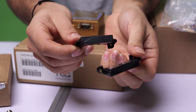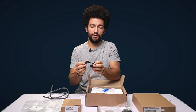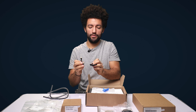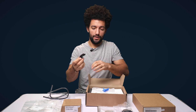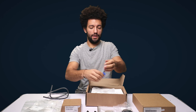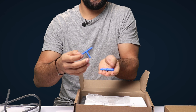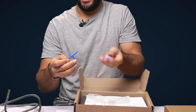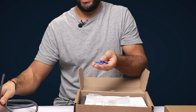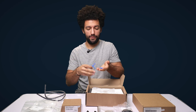These two adapters are to be used to allow you to fit the TC20 control head into a standard 57mm instrument hole, very widely used in gliders but also in many powered aircraft. We've also got some pneumatic connectors — a T-piece and two straight pieces — just to allow you to easily connect your TC20 control head to get a static pressure feed for the transponder.